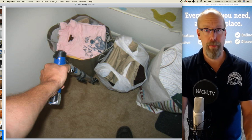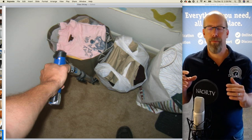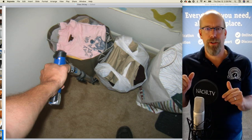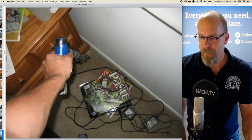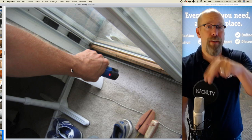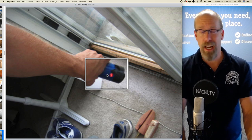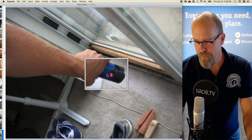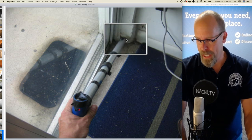And then I get out my moisture meter. You're not required to have equipment like a moisture meter. The standards of practice actually doesn't even mention a flashlight, but every home inspector has a flashlight, maybe a screwdriver, a GFCI tester, and I have a moisture meter on a stick. It has pins, and if it finds moisture, it'll light up just like this. It's lighting up. That means it has detected some kind of moisture. I'm not measuring the moisture content. It's basically a very rudimentary way of seeing if something's wet, and it's wet here.